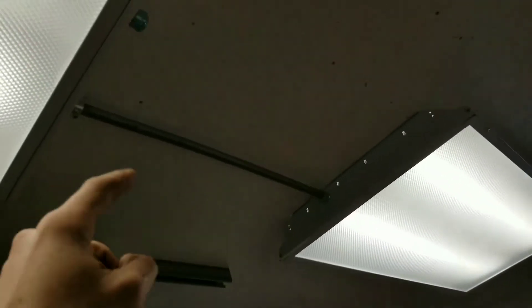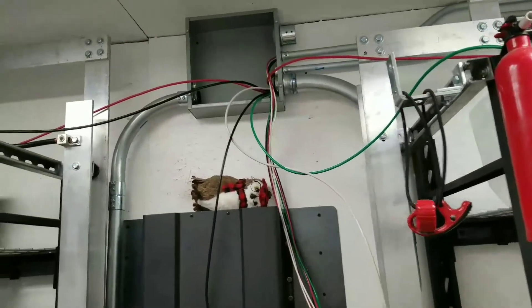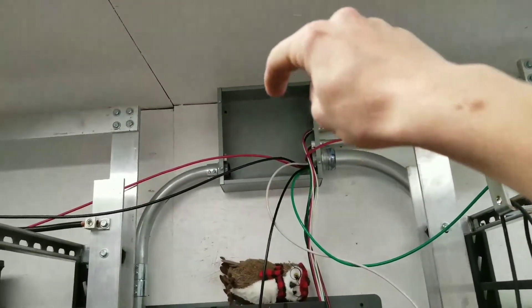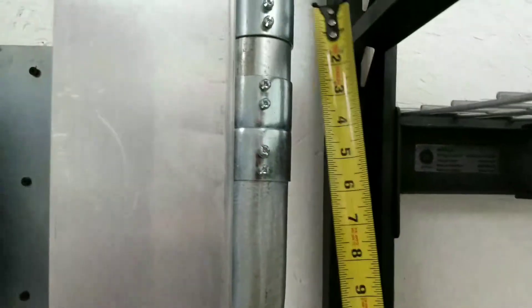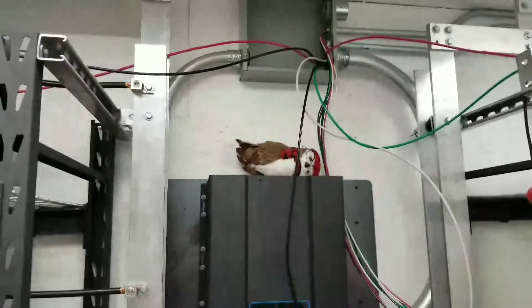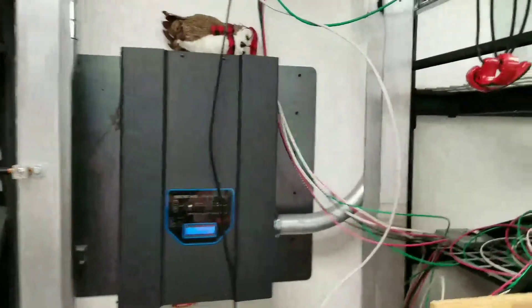I got the conduit pulled out, and I do need to do something about this one right here for the lights. It was suggested by a YouTube channel named Wes Adams — he said, what if we just lower this can down and have the gutter come across the top, then just chase a nipple down into the can. That's a great idea, but I have 6x6 gutter. Using the Fat Max, being careful not to touch it across the bus bar, we have 4.5 inches we can drop on these couplings on my back-to-back 90s. But I think the only way that would work is going into that top hole on that can with those back-to-back 90s.